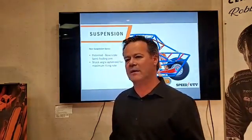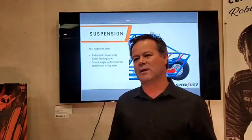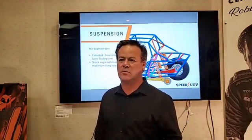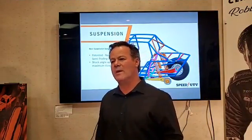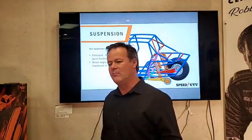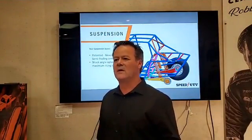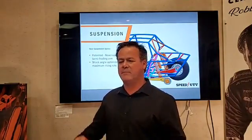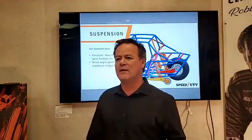Same thing when we talk about that. I think we got 5 or 6 wrenches to work on the whole car. We've got a lot of common bolt sizes throughout the whole car, and we've also, right from the factory, built bolts and adjusted our pivot points where we have shoulder all the way through. So we don't have bolts stopping in the middle of the spread at the weakest point and loading the bolt.